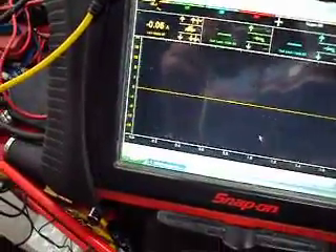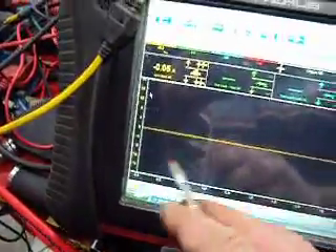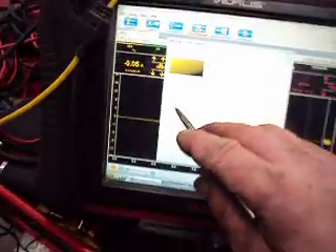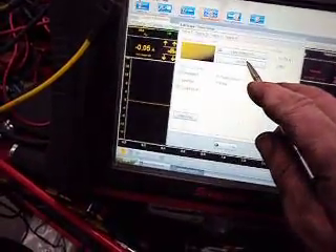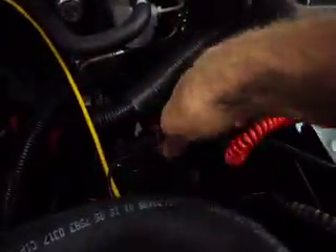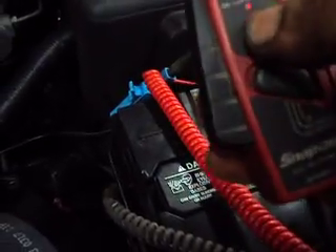One more time here. We're on 40 amps, which gives us a 40 amp amplitude, and we're on AC couple. If we go over here to Traces, we can see that AC couple displayed 40 here and then low 40 amp probe. So we're good there. We look at our current probe and we see we've got it on a 40 amp setting.